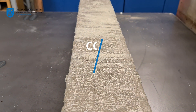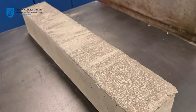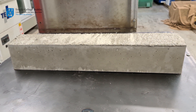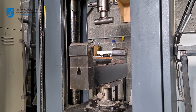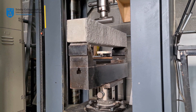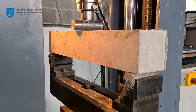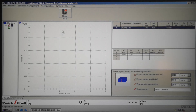In week 11 you will bring your beam from station 5, where the hardened density was determined, to the experimental rig in the test hole. Please take a moment to check the condition of your beam and note any air voids or defects within the specimen. The demonstrator will place your beam into the machine and bring the loading ram down until it almost contacts the top of the specimen. The test will then be initiated via the software, and the desired loading rate will be applied to the beam until failure occurs.